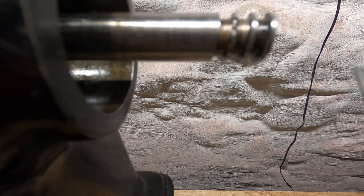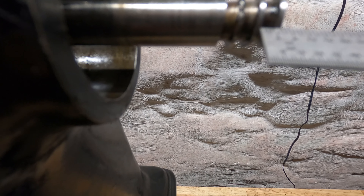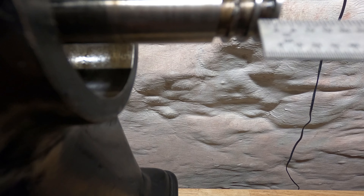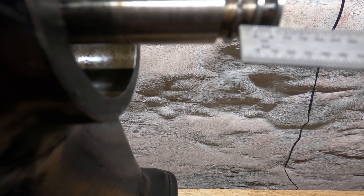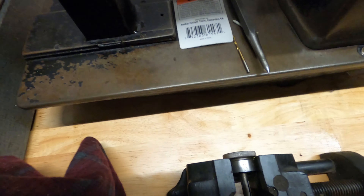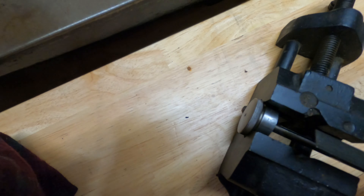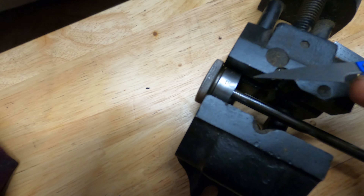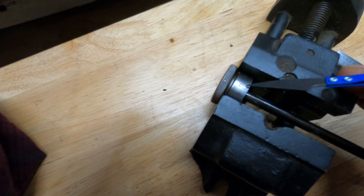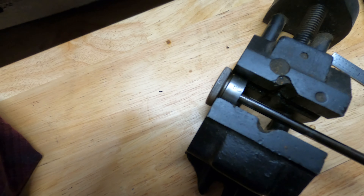I need something smaller. The spacing between here — if you look — it's like five thirty-seconds. That's the end, but right there: one, two, three, four, five thirty-seconds. So what I'm going to do is take this thing here and measure five thirty-seconds. This is the center of the pin — you can see that circle. Line up with twelve; that's where the pin is. So I'm going to put a second pin five thirty-seconds from that center, and I'll drill it in.